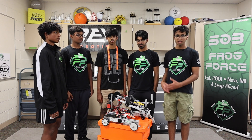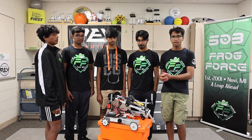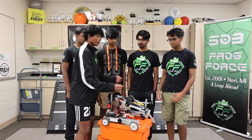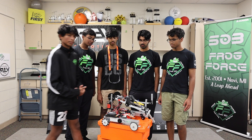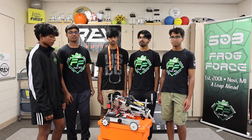Now that you've seen how our robot works and what it's made up of, we're going to talk about some things that you can do to improve it and make your robot even more competitive. For the climbing hooks, you can add a mechanical component so that both of them become synced, or you could have an encoder and just do it in code. You can also invest in a set of mecanum wheels so you're able to maneuver around the field much easier.